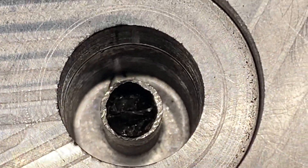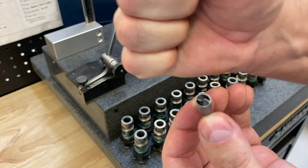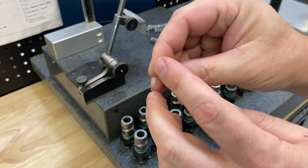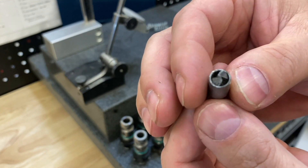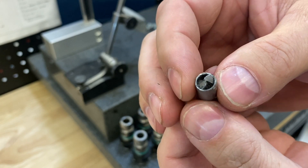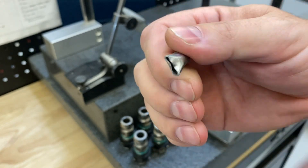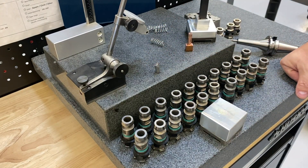What I ended up doing was basically milling around the drill. The J drill was just a pilot hole, so I milled around it, put a screwdriver in there, and wedged it. You can see it kind of folded over on top because it was in this orientation. This is the actual carbide drill, and you can see that's the actual drill tip — the original factory tip. So I milled down around it and just broke it off. Pretty interesting situation.